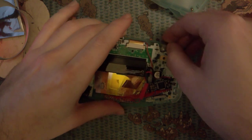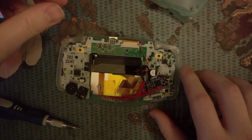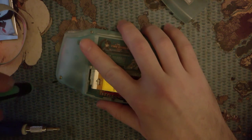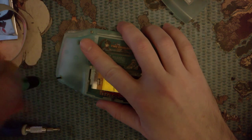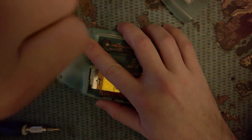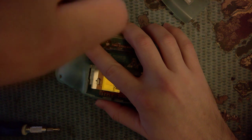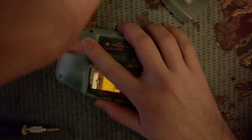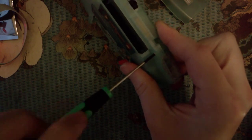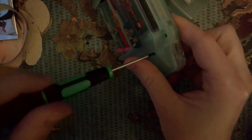If you're like me, you probably have a whole book full of resistors, and 320k just wasn't a value that was in any of my resistor books. I checked both my through-hole book and my surface mount book, and there just wasn't a 320k resistor. So if you're buying parts, just buy the correct resistor, use Alex's firmware, call it a day. But if you've got every other part already except for the 320k, don't make an $8 order on DigiKey just for the one resistor. Just modify the firmware and use mine.